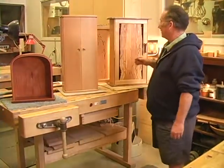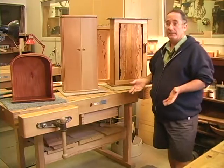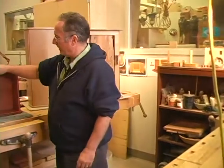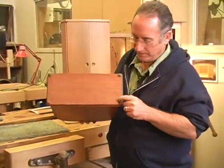A lot of students have grandiose plans and don't get started until late, so they have to finish it on their own or come back another semester. So here we have three cabinets that encompass quite a few different joinery techniques. We're going to be talking about doweling, which is how the carcasses are connected in the case of all three of these cabinets. And we're going to be talking about frame and panel, dovetails, mortise and tenon, and dados. This one is actually a laminated piece that's been doweled through the bottom — you can see the ends of the dowels here.